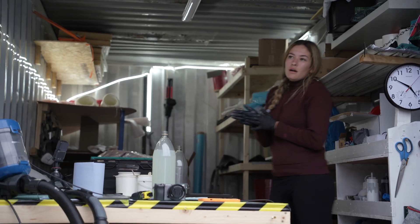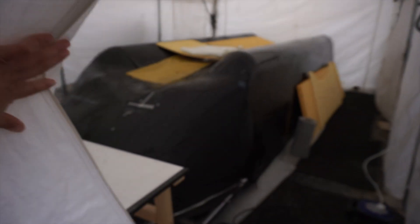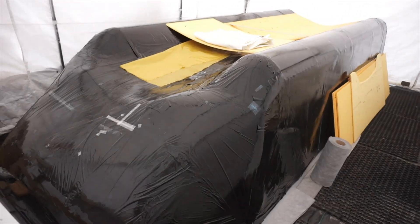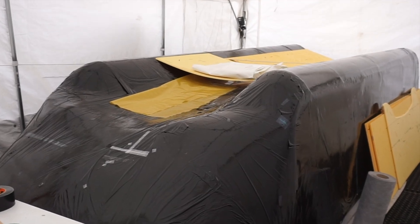Whilst the resin potting would take an hour or so longer, I wanted to make use of daylight. It's mid-October at the time of filming and our long summer evenings are a memory. We had mould work to finish. On top are those troublesome foam sheets — the short section I'd tried to cold bend with some weights, which does not work. The rear section I'd formed in the oven to roughly the right curve, but it's not uniform and will cause drama.